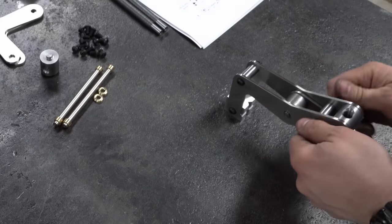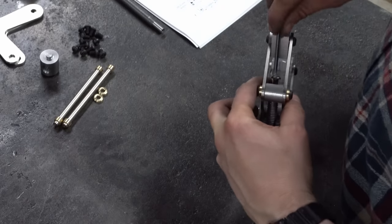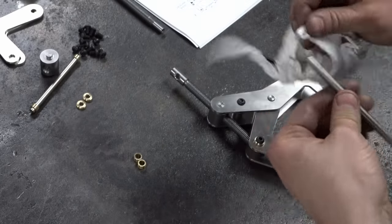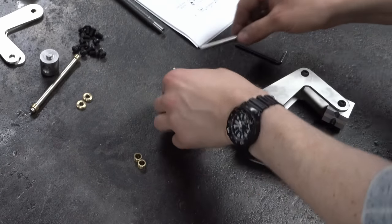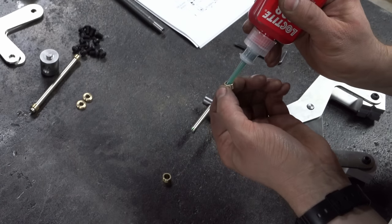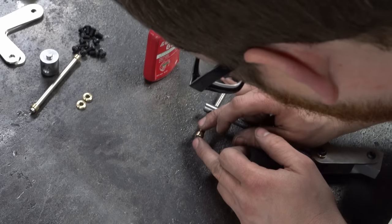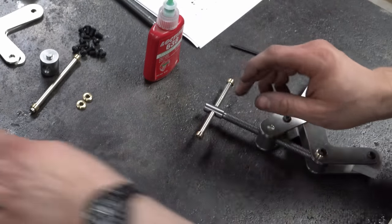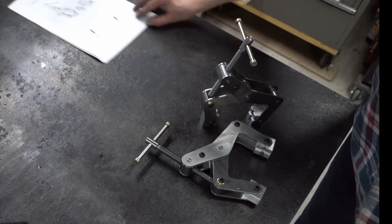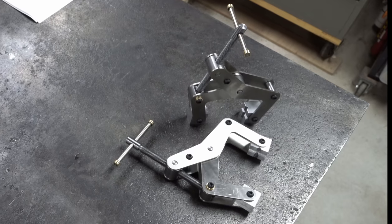In a couple of areas I had a bit more clearance than needed, but that's because I'm using stainless sheet that's a bit thinner than the 11 gauge the plans call for — the sheet was just what I had in stock. A little bit of clearance in a clamp is no big deal; it's not a Stirling engine. We'll use some Loctite for the handle tips — those just get placed on, and the rods are left horizontal so the tips shouldn't move. And there's the finished pair of clamps. They work brilliantly and are very substantial. I like how they look like they're part of a robot. The plans were great and I can thoroughly recommend them. Thanks for watching, special thanks to patrons, and I'll see you all next time.